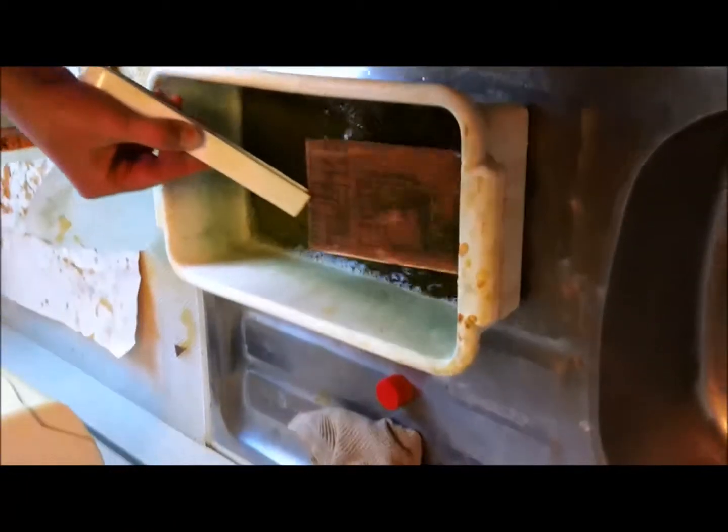This is the crucial bit — just the right amount of time. If you leave it in too long, the copper layer — the green bit that you want — will start to dissolve in here, which is a disaster. That's one of the reasons I say thicken your tracks up; there's less chance of them dissolving.